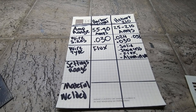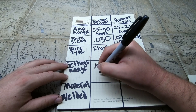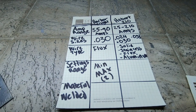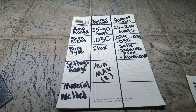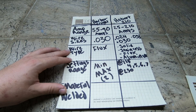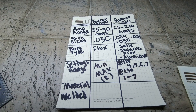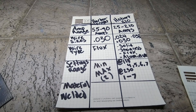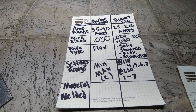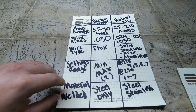On settings: the Harbor Freight only has two — minimum and maximum. The Hobart has 11 different settings. On 115V you can use settings 4 through 7; on 230V you can use 1 through 7, giving you at least 7 meaningfully different settings. For materials, the Harbor Freight can only do steel, while the Hobart can do steel, stainless, and aluminum.